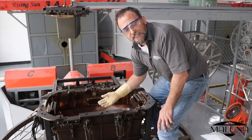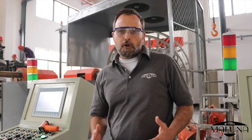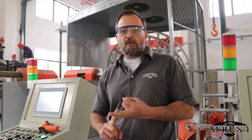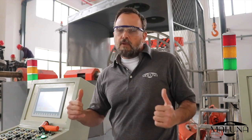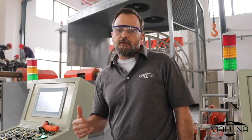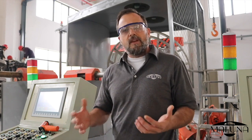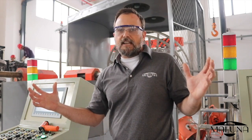Next I'll show you how the different phases of the rotomolder work. You've heard me say it takes an hour for each cooler on the rotomolder — it's basically 20 minutes setup time, 20 minutes in the oven, 20 minutes cool down time. The rotomolder oven is big enough that you can park a car into it. When the coolers go inside the oven, the reason they call it 'roto' is that the molds rotate on all axes to get the plastic into every single part inside the wall, and it creates a hollow product before it gets filled with insulation.